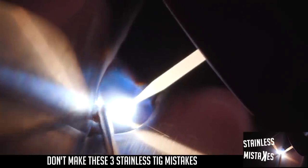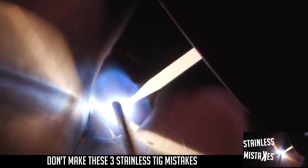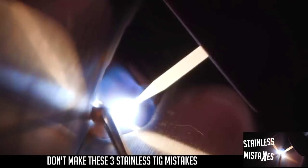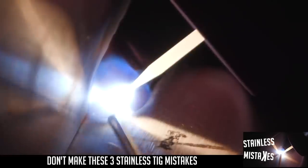There are people running way too slow, way too much amps. When that happens, you're going to cook the stainless. You're going to cook all the chromium out of it and all the nickel. So when we get done here, it's going to be dark colors — probably dark pink, maybe all gray, probably all gray.